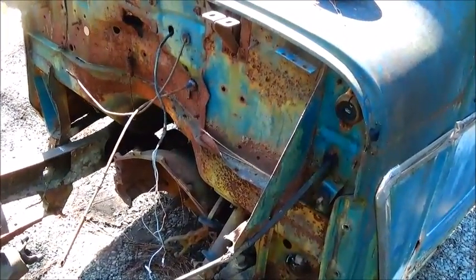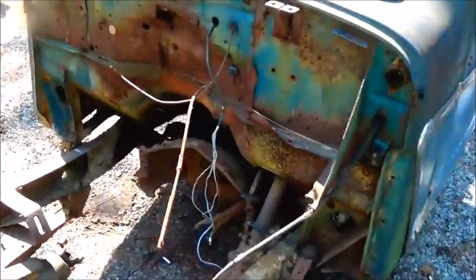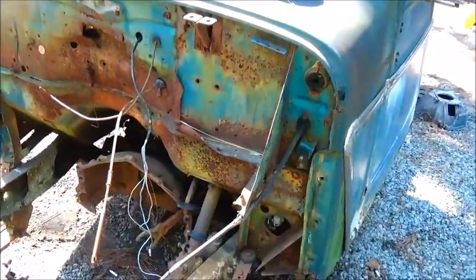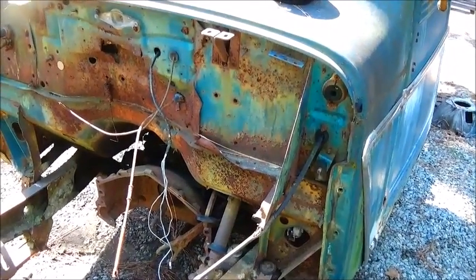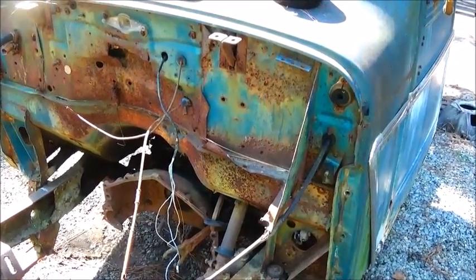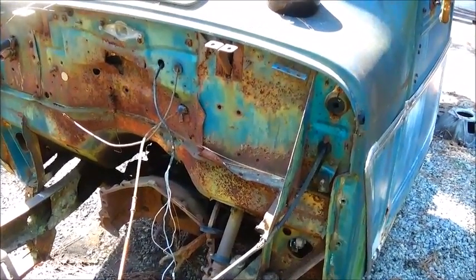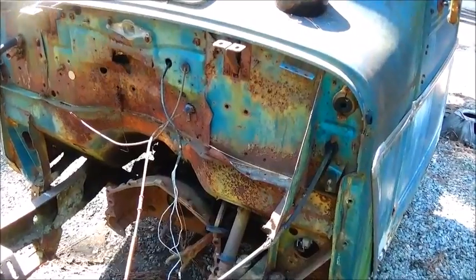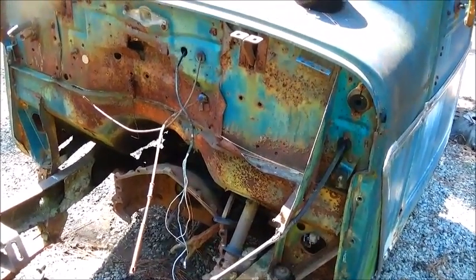I'm thinking maybe the 70 Chevy Impala down there has got a non-power brake setup. So we may run the pedal out of it, and the pedal bracket above it. We can pick up a new master cylinder for a 70 Chevrolet, and that'll be our two-stage master cylinder. So if we lose our front, we'll still have our back.